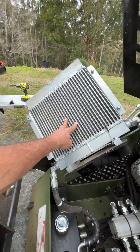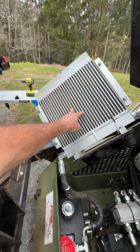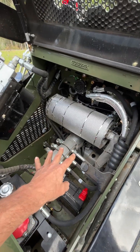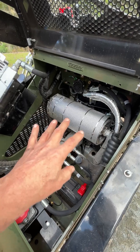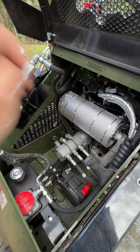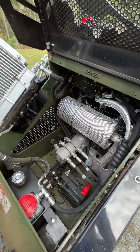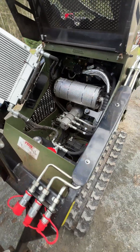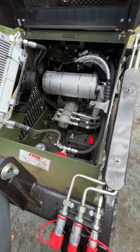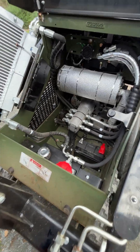Yes, we're getting a great cooling temperature at the radiator and possibly at the hydraulic oil, but we're blowing heat in on the engine. The engine doesn't have any oil overheating protection — it'll just burn itself out. You'll be looking at burning out your valves in only 150 odd hours, premature engine wear, pump wear, and every other component.